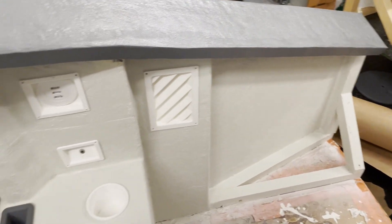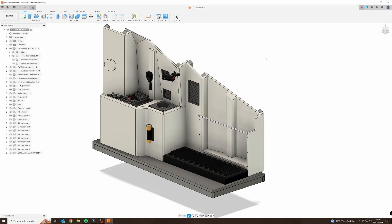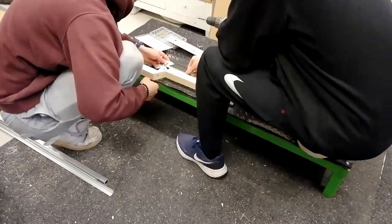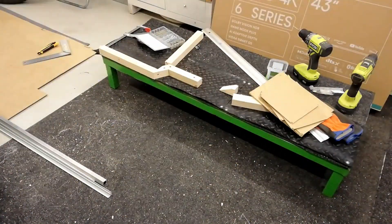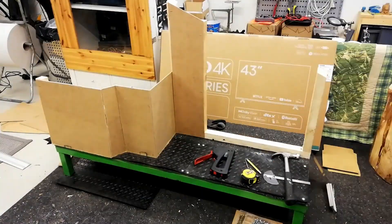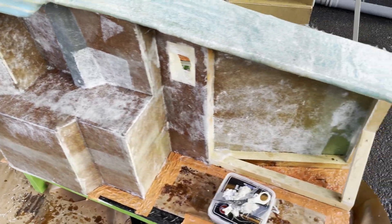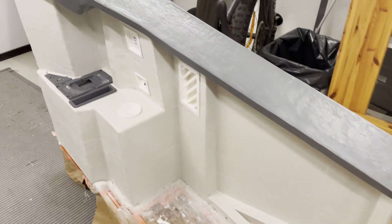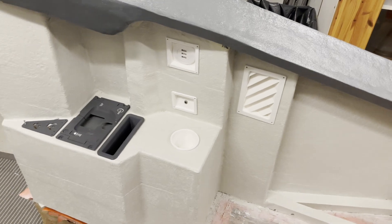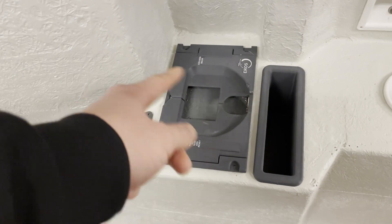The side walls look super realistic. Like the main modules, they were made out of fiberboard and then fiberglass later. The main structure was made of 40×40mm wood, with fiberboards installed on top of that, then fiberglass, then filler — sanded and repeated a few times to achieve a really nice look. I can show you a little bit of the side walls here, although we haven't released the video yet.